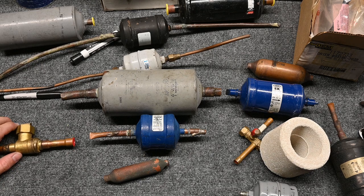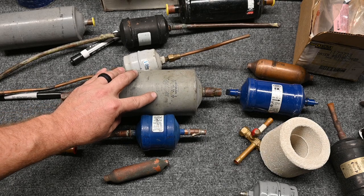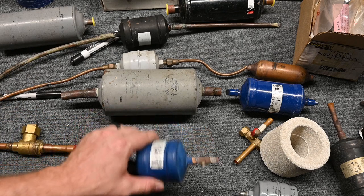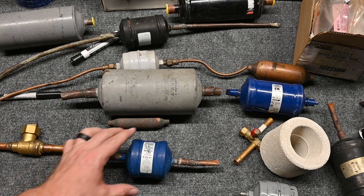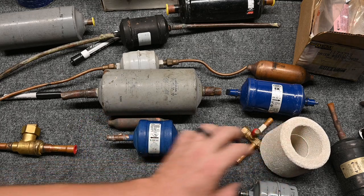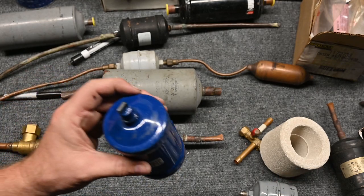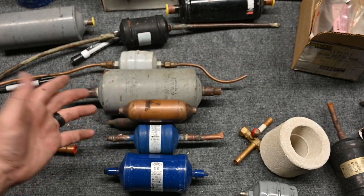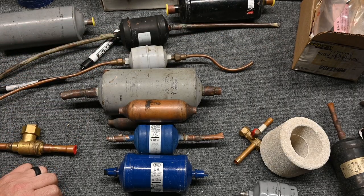So that's pretty much the gist of our liquid line filter dryers — here's a quick review. The center two numbers are your desiccant size. The last number is going to be the size of the piping. If you have a letter, it's going to be either S for sweat or F for flare. You want to make sure your filter dryer is ideally inside. But if you do have it outside, make sure it's protected, not going to rust on you. Make sure it's the correct direction — flowing away from the condenser, towards the metering device. Always make sure there's only one filter dryer in the system. Anytime you open the system and change the filter dryer, leave the caps on until you're ready to use it, and never blow through these filter dryers — the moisture from your breath will contaminate and completely ruin the filter dryer.